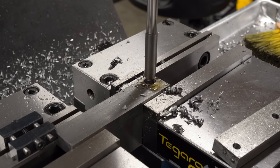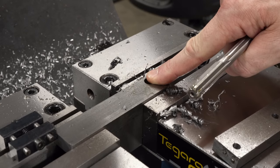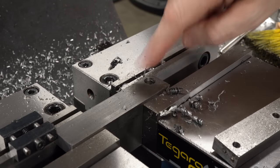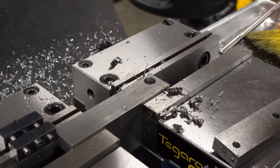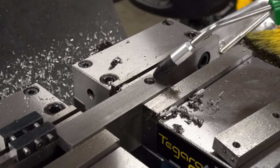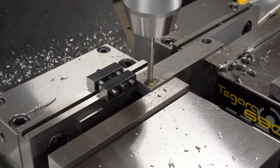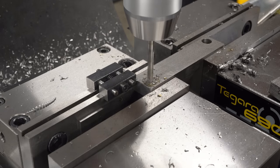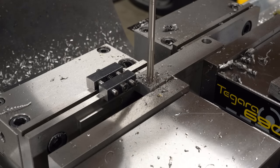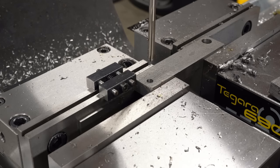I screwed up - I was supposed to use a drill one size under 7/16 inch, and I used a 7/16 inch drill. Since this is a bushed hole, I think I can just go ahead and turn the bushing slightly oversized, force it in, and we'll be fine. I'll know it's there, but nobody else will - if you don't tell anyone. Since I'm not going to remake the part, we'll go ahead and finish it and put the quarter inch hole in for the knurl pin.